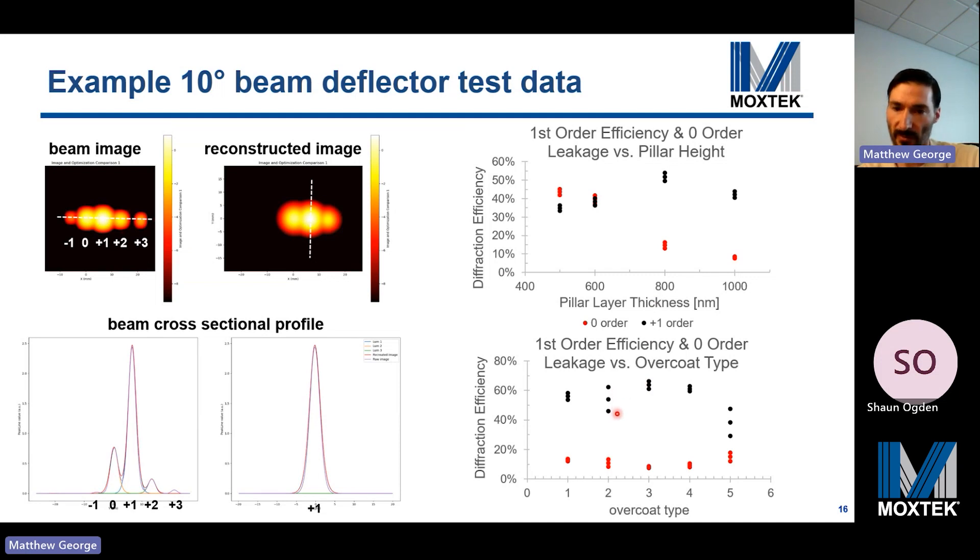The middle points are the mean and upper and lower points are plus or minus one standard deviation. The remaining light goes into reflected modes, the unrefracted zero order (about 8%), and second and higher orders (about 3.5%), with very little into the minus first order. We're looking at ways to minimize those unwanted stray light beams by improving our etch profile, though in some applications the leakage is less critical. Recently we've achieved 75% to 85% and even 90% first-order diffraction efficiency by improving our etch profiles and adding anti-reflection coatings — very close to our phase review targets.